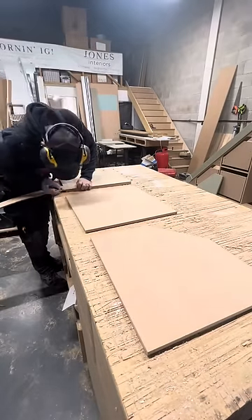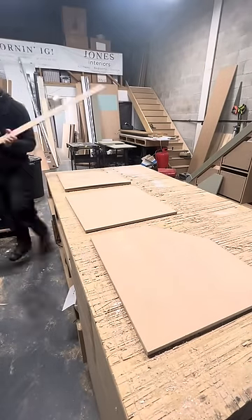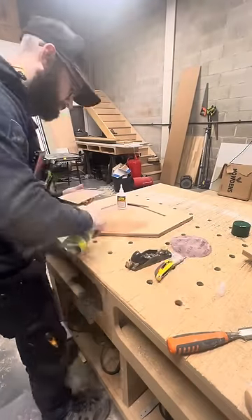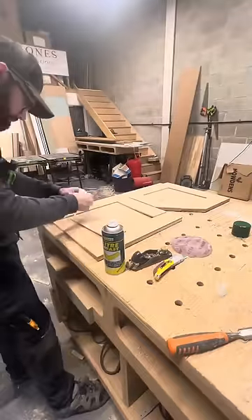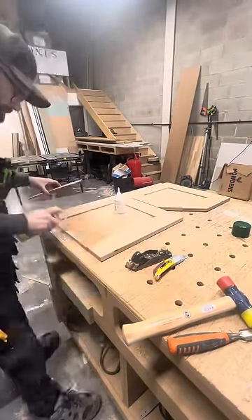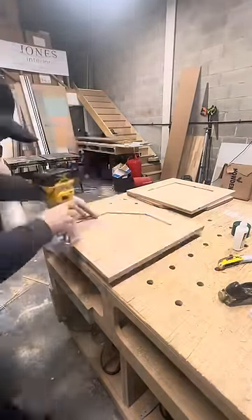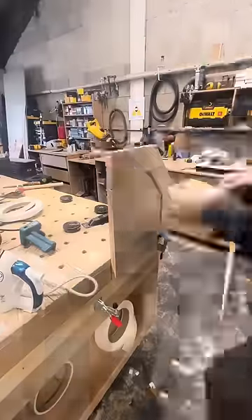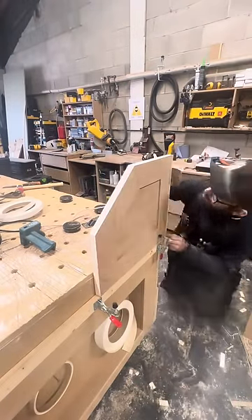One of the end-of-stairs units is having a shaker style door. To create the shaker style door I use 12mm MDF and then 6mm on top for the stiles and rails. Then I use mitre fast adhesive to attach them. Using flush cutting bits in the router, I flush everything up and then start edge banding all of the edges to hide the joint and make it easier for the painter to deal with the edges.